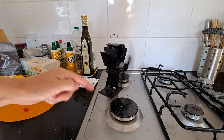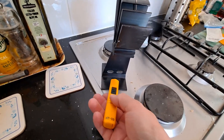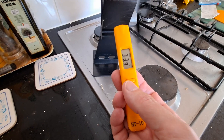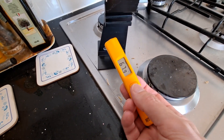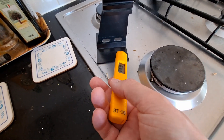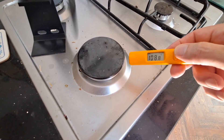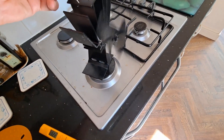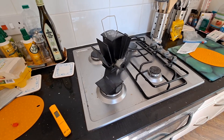Obviously that's going to keep running until it's cooled itself down a bit. I'll leave it like that because that will remind me that this is hot. Just another little check - if we point this down here, 69 degrees now, and up here 33. So that's your temperature difference: 33 at the top. That is cooling down fairly rapidly - 67 now. That's still hot, so we don't want to touch that. I'll stand that on there and that will keep running until it's cooled down.